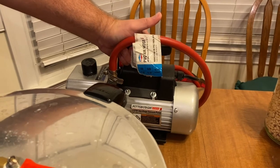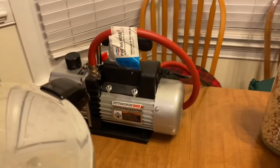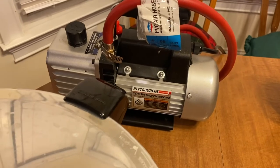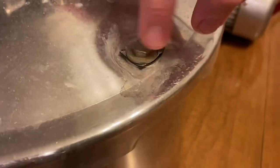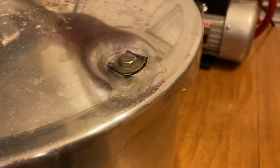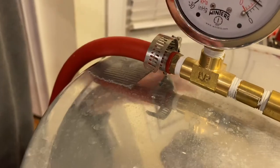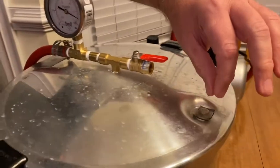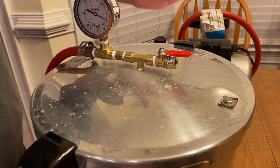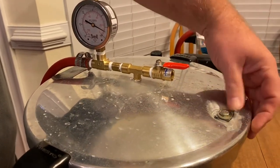The major cost of the whole works is the vacuum pump. If you watch your emails or any magazine, they seem to have a 20% off Harbor Freight coupon — so if you can find one of those, that would be the time to get it. There's a safety side and a blow-off side. I just put a piece of duct tape over the blow-off side — you're not pulling that much of a vacuum in here. The other side was the little pop-up thing that keeps you from opening the lid when it's under pressure. Since we're not under pressure but under vacuum, that was not necessary, so I took that apparatus out and sealed it with a homemade gasket and nut and bolt.